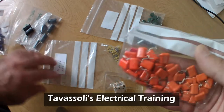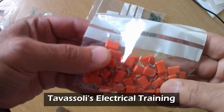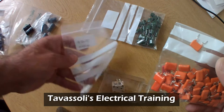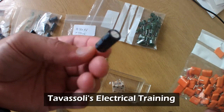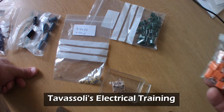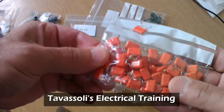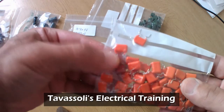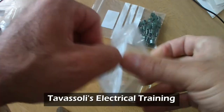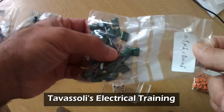And then we come to different types. The types of the capacitors are identified by the material used as their dielectric between the plates. So if the dielectric between the plates is chemical, which is usually the electrolytic ones, you have to observe the polarities of them, because you can explode them. But the other ones don't have polarities like this one. These are ceramic and mica types, or tantalum ones. And these are all different types. For different sizes, you can get different types and different working voltages.